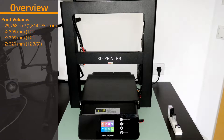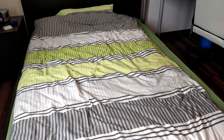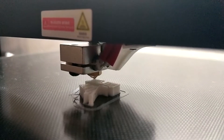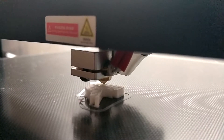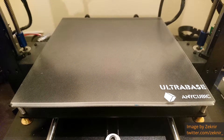Let's start with an overview. This Cartesian printer is quite large compared to my other machines. The print volume measures 305mm or 1 foot on both the X and Y axis, and 320mm or 12.5 inches on the Z. It's pretty much a finished machine right out of the box — you will just need to install 7 screws and connect 3 plugs. It is a single extruder machine and comes with a parts cooling fan. It uses the same nozzles as the E3D V6 hotends do, although the hotend is probably their own design. There is also a heated bed with a glass plate and some coating that feels and behaves very similar to the Anycubic Ultra Base.